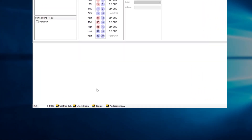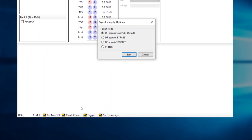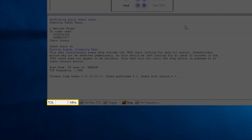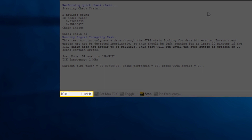It's launched from Check Chain's drop-down menu at the bottom of the window, and you're then offered four options. Run each mode for around 10 to 20 minutes. It'll use the default frequency from the bottom of the screen, so you'll need to set it to whatever speed you'll be using in production — just type that required frequency into the box.